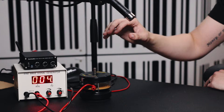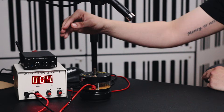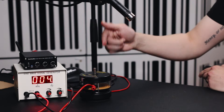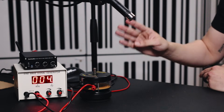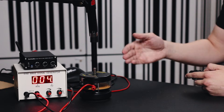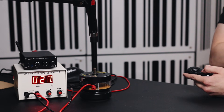Here, I have a transducer connected to a signal generator which can output AC, or alternating current. When I play a very low frequency signal through this circuit, we can actually see the coil moving at that frequency. If the frequency is 4 hertz, the coil and the piston connected to it will move up, down, and back to the center four times per second. We only hear down to about 20 hertz, so we don't hear this 4 hertz signal, aside from a bit of squeaking going on inside the transducer. But if we start to increase the frequency supplied by the signal generator, the piston will eventually move so quickly that we can't even see the motion. And that's at 27 hertz, toward the very start of the range of human hearing.